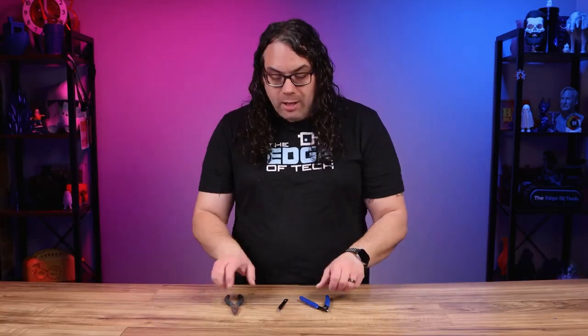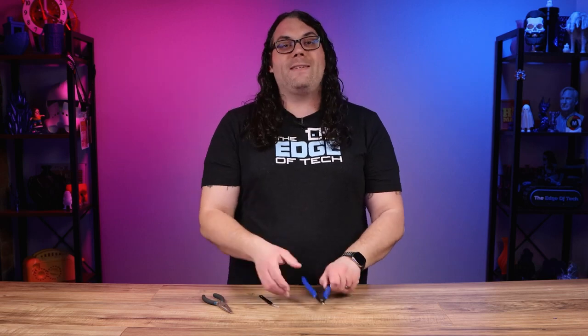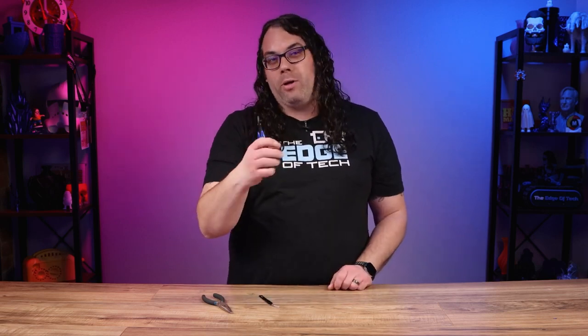Then what you want to do is remove any excess material or support structures if there are any printed into the model. This will typically involve tools like maybe needle nose pliers, tweezers, and the side cutters that probably came with the printer you bought. Just be very careful when using the side cutters because these will cut you, so you don't want to do that. Finally, admire your finished 3D print.